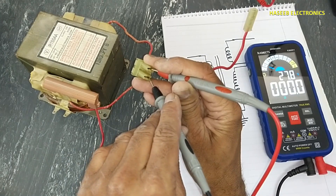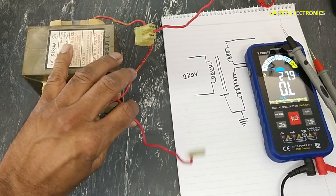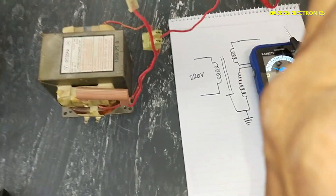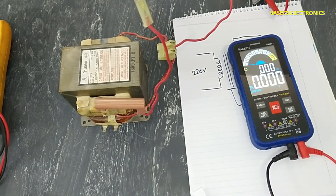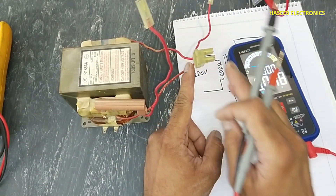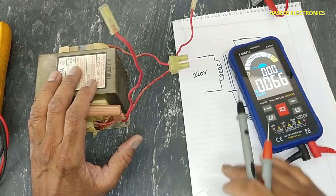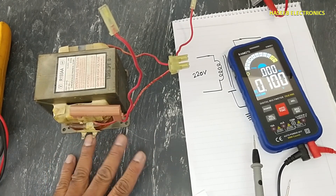This is the low voltage winding — it must be open with respect to the chassis. It will give around 0.1 ohms. Now we will perform live testing. During live testing, take care: this is a high voltage wire, never touch it when power is applied. Set the multimeter to AC. This is the low voltage section — the winding with low resistance is the low voltage section. When performing live testing, never place the transformer on any metallic or conductive surface; place it on a wooden rack.